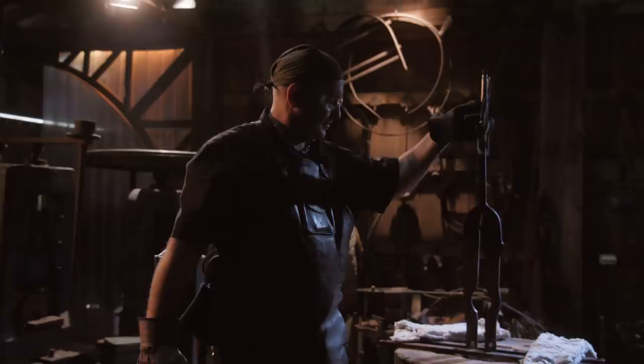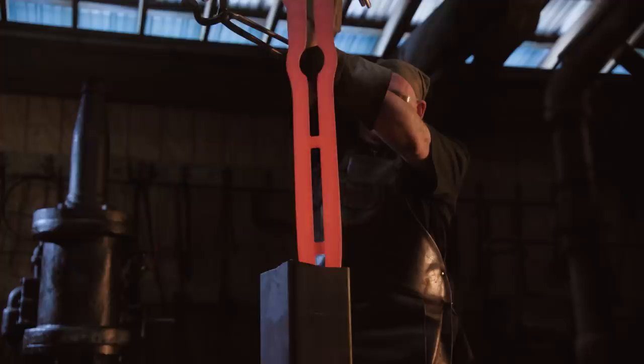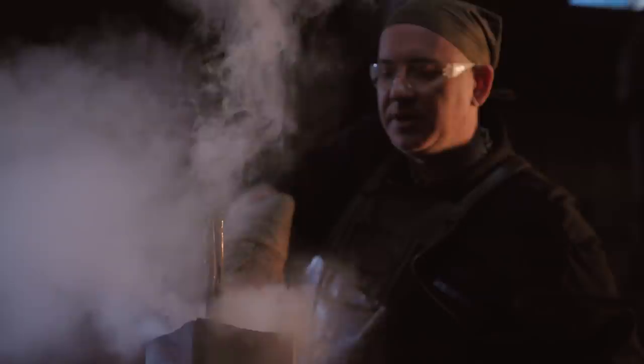Decker now heat treats this massive blade. The heat treating of Eclipse is actually extremely complex. When you heat treat something that's been twisted, it'll untwist. What we've done is bridge the gap between the two blades, welded in some pieces that'll be cut out later. That should allow us to keep the blades equidistant and at the same time prevent the twisting.